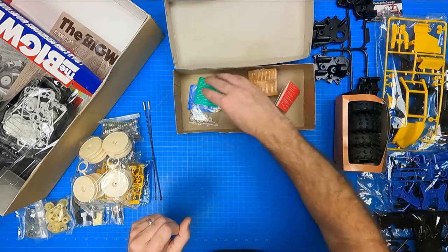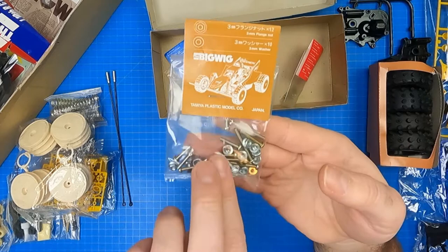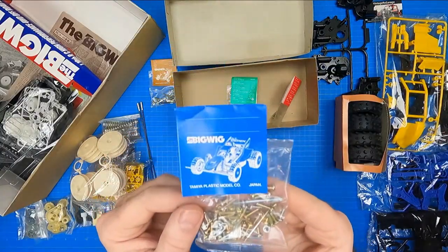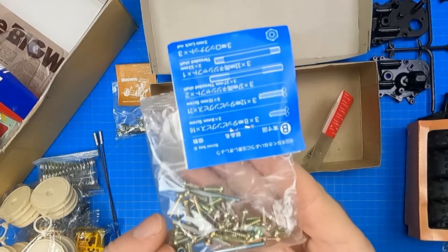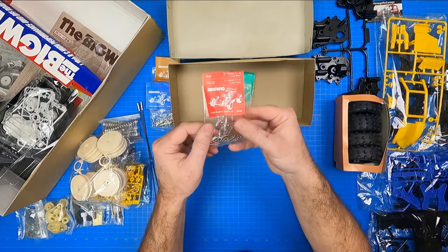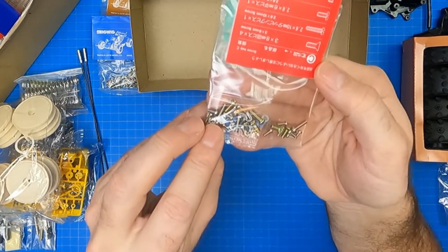The last items inside the blister pack box are the screw bags, in order. There is a rather small set of hardware used in the four bags. Screw bag A has 3mm machine screws in 6, 15, 20, 27, and 30mm lengths, 3mm flange nuts, and 3mm washers. Screw bag B has 3mm threaded shafts in 33 and 37mm lengths, 3mm lock nuts, also 3mm screws in 8 and 12mm lengths. Screw bag C is the catch-all bag. It has 2.6x10mm screws, 3x10mm, 2.6x6mm, and 2x6mm machine screws — my nemesis — 2mm e-rings, 3mm grub screws, and finally 3x8mm tapered head screws.